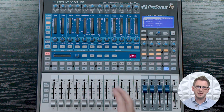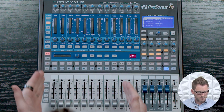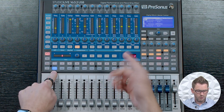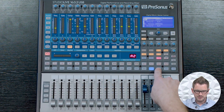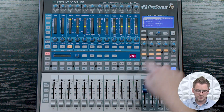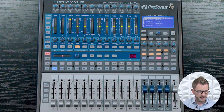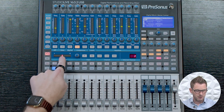Moving over to the channels, I want to talk about the channel processing. I'll go ahead and select channel 1 — the selected channel display here will show which channel I have selected, and we can go through and select all of our channels. If I go and select an aux, we will see that this says Aux A1, A2, meaning Aux 1 and Aux 2. We also have our main and can select Effects A and Effects B. Now on the bottom of this fat channel, we have the ability of panning this channel from left to right or keeping it directly in the center.